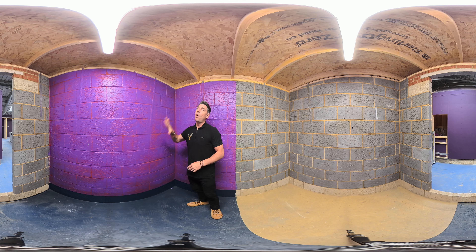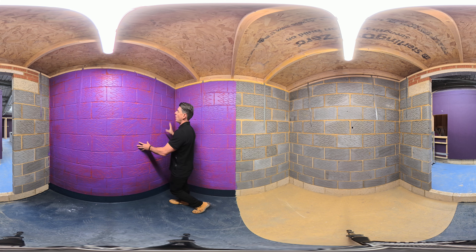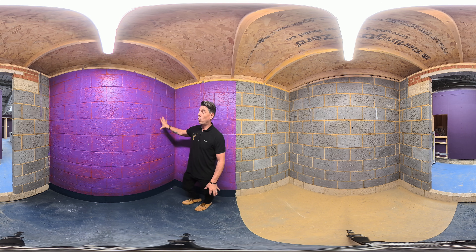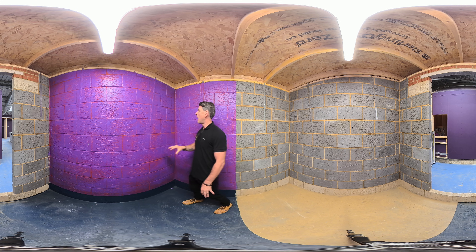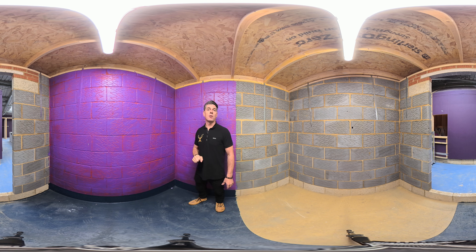Over on this side, we've completely sealed all of the airtightness on this wall with Passive Purple. All the straps have been completely covered. All the floor has been done with waterproof glue, so we've got a nice DPM there — liquid control, liquid applied — so we're airtight and watertight. On the walls we have the Passive Purple, which is airtight and provides our vapor control.